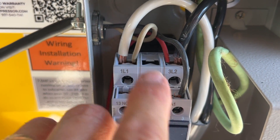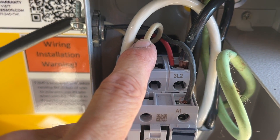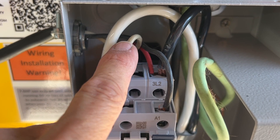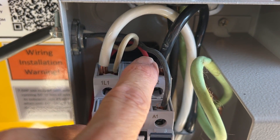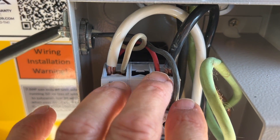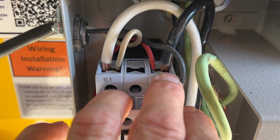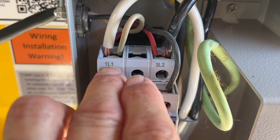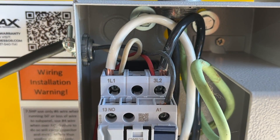You just have to keep these two wires in there. These are little bitty wires, and these are huge wires. So when you unscrew it the first time, these little guys — the red one kept popping out. You've got to finagle them. You've got to get the big six-gauge wire and the other wire both in there. One power goes to 1L1, the other goes to 3L2.